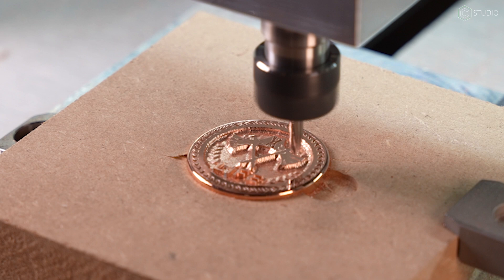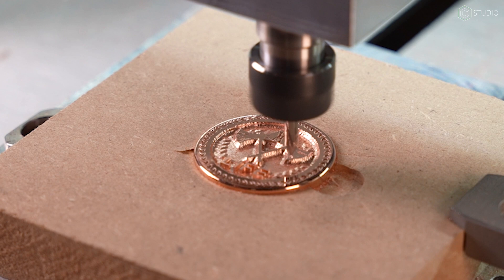The life side of the coin is where I brought the PCB mills into the project. The 40-degree, number 502 PCB mill added extra details into the areas where the MC Etcher just didn't provide enough depth and relief. This would pay dividends later on another coin.